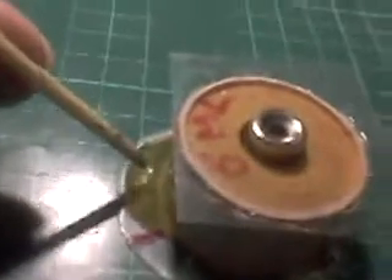We're waiting for it to harden now. It's still very, very liquid at the moment, so I'm going to have to leave it quite a while. I put a piece of plastic over the top so I get a nice straight top — the top of the bobbin will be flush with the mould, which is obviously what I need, because that's the way the original one was done.